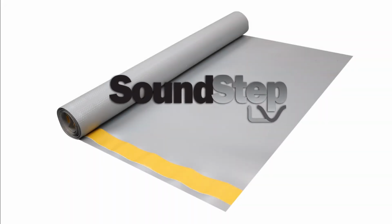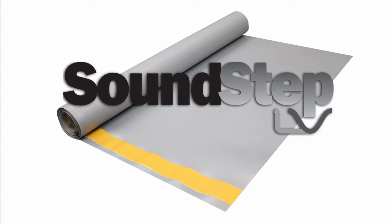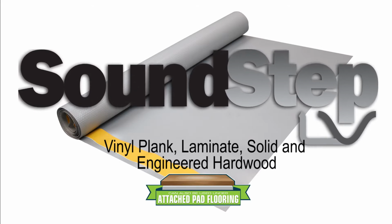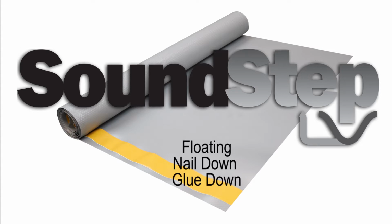SoundStep LV multipurpose underlayment is a 1 mm thick crosslink foam material that easily installs under vinyl plank, laminate, solid and engineered hardwood flooring, and a variety of installation methods. SoundStep LV multipurpose underlayment can be used in floating, glue-down, and nail-down flooring applications.